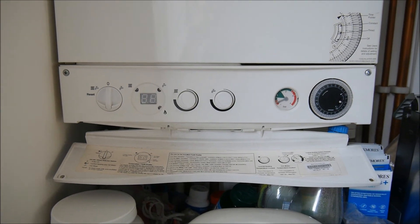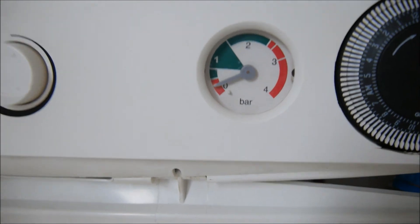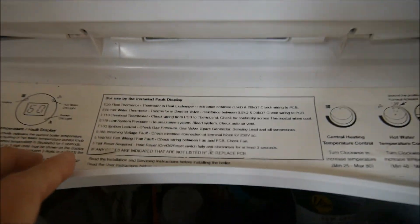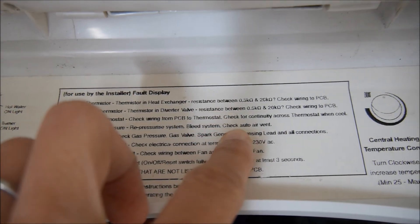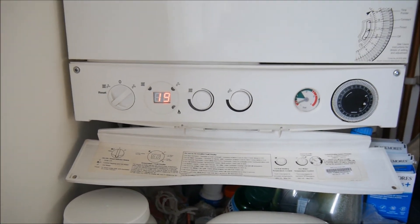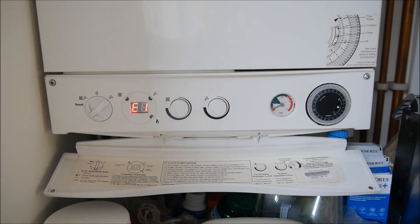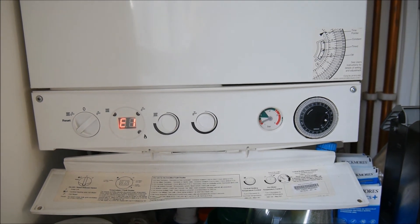The last thing you may have to be aware of is that when you have done the air releasing and all the maintenance procedures, coming back to the boiler, you may see that the pressure has dropped below the green zone. When you turn it on, it will show the E119 error code. E119 means low pressure, low system pressure - repair system, bleed system, check all the air vents. The low pressure occurs because the air has been released, and the whole system used the water and air together to maintain pressure before. After you have released the air, the water has to fill up the whole system again.